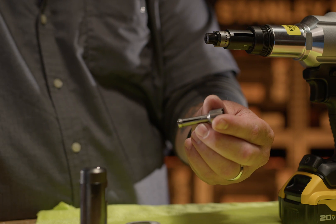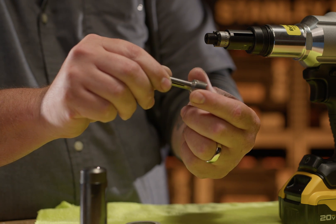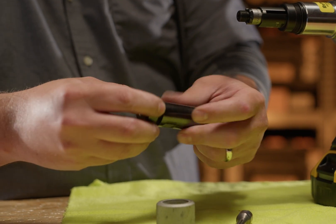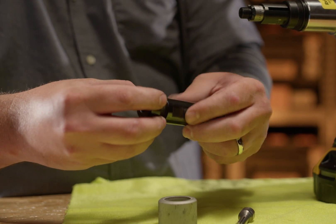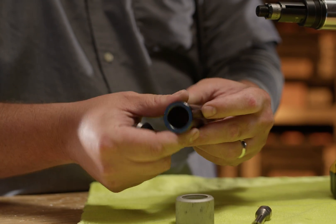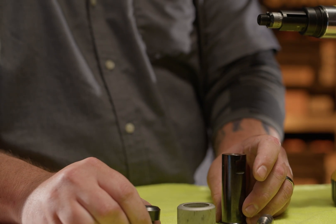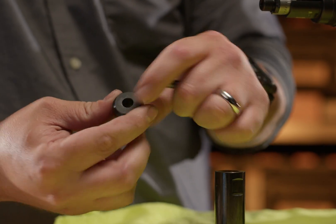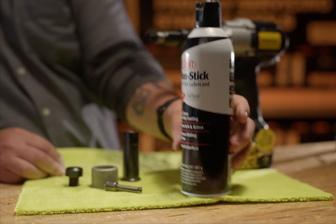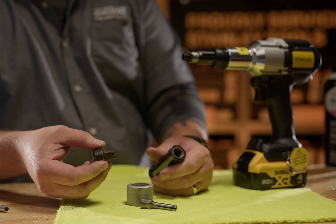Next, inspect the collet and check all the cracks and crevices for chips or debris. If there is debris, wipe it out with a wire brush or blow it out with compressed air. Then unscrew the nose housing and the anvil, wipe the inside of the nose housing out with a microfiber towel, and do the same for the anvil. When you're done, lube up the hole of the anvil and the collet using a non-stick dry film lubricant — just lightly coat it. Once this is all done, you can reassemble the tool.